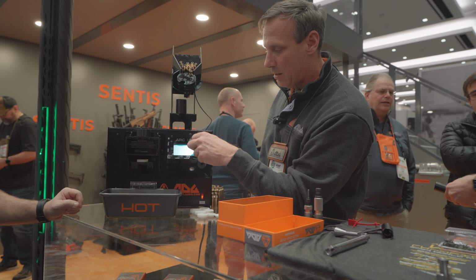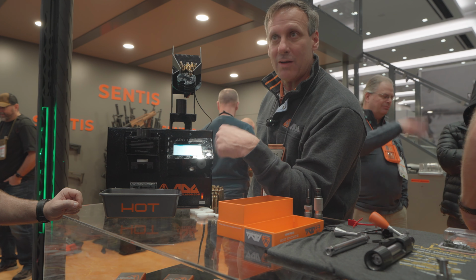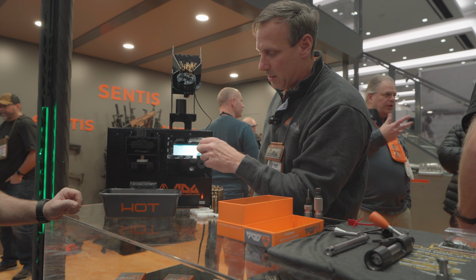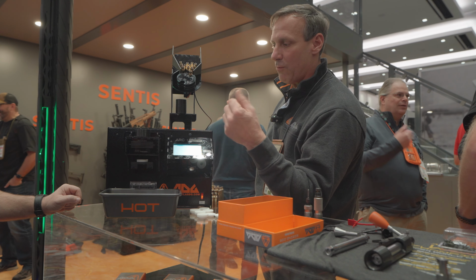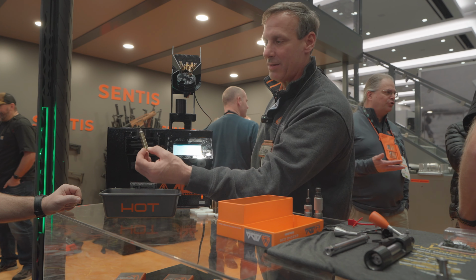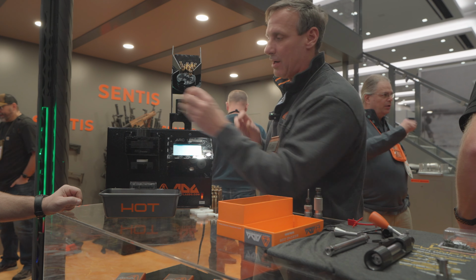So we'll say we're looking at the second from the bottom sensor. In the unit that we release in March, that will be saved in your memory settings. And then when I'm ready to anneal, I just drop the shell in and hit the anneal button. It does a preheat cycle to about 200 degrees Celsius to make everything uniform, and then it does the actual anneal. And then I have an annealed case that I can hold for about that long before it starts burning my fingers. And then if I want to anneal another case, I can just drop it in.